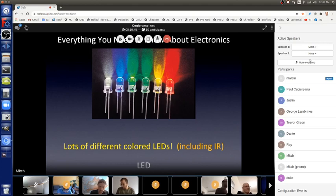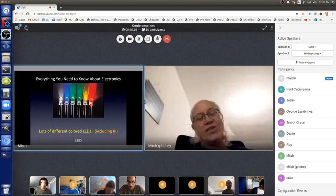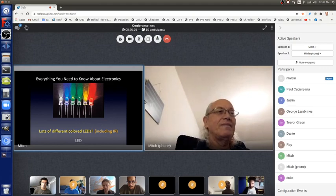So infrared is invisible light that is used in remote controls for televisions. You blink that infrared with very, very short but very specific intervals, on and off and on and off at just the right rate, so that when a Sony TV sees that sequence of infrared light, it turns off and makes the world a better place. And then Philips and Panasonic and all these others have different intervals and different ways of blinking light, but it's just infrared light blinking on and off and on and off.